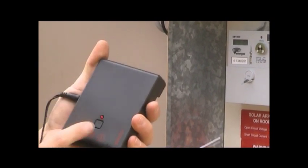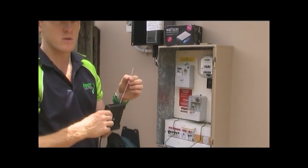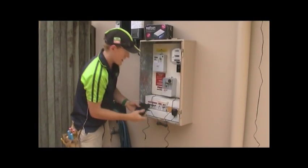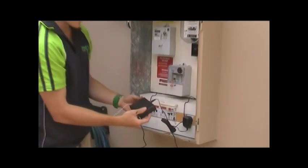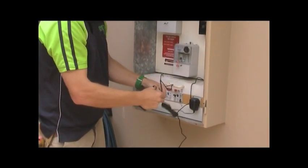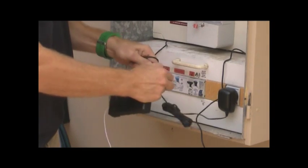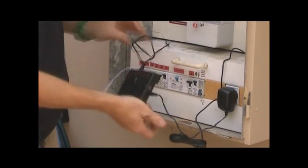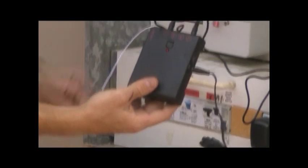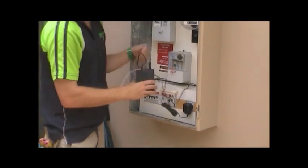There is a button on the front of the screen — that comes into play whenever we're pairing the units. We'll get to that one in a second. We do have an aerial — it's always good to keep these aerials as straight as possible as it does help with range to inside. So we simply go and plug that into our 240-volt outlet. We then plug our single-phase AC into number one, and then we have our solar supply main switch into our renewable. There are quite a few wires here, so when you actually do come to installation, you can use double-sided tape just to hold this back against the door.